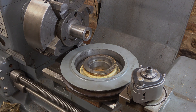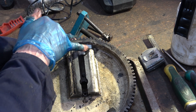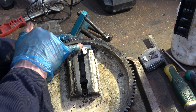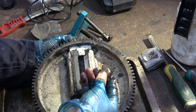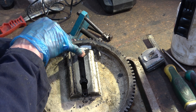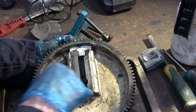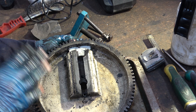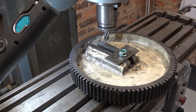This T-piece I made out of white plastic just stopped the slider coming up too far and off the end of the broken track, but it limited our stroke to 9 inches — I want to get that back. Here's the piece that broke off — it's all there, but there's no way to fix it where it needs to go; the broken piece is too thin at that point. I think the easiest thing is to machine across here to this point, keep this pillar, put a piece in here and screw it through — maybe extend it so it presses up against this. We can do that on the mill. It's poetic that my first real job on the mill is to fix the shaper.